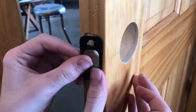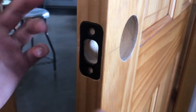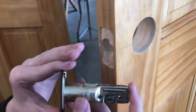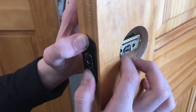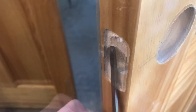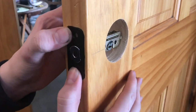Now this fits in there just right — it actually holds itself in there, which is nice. Everything is pretty clean. It's a little long; you can see a sixteenth of an inch gap there, but that's 100% fine. Putting the actual deadbolt in, there's a little more thickness to it — there's a plate right here, so I'll need to carve in to match that. I carved this a little deeper and now it fits in there nice and flush.